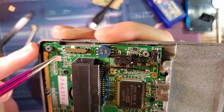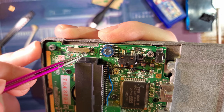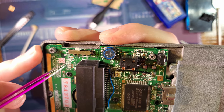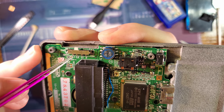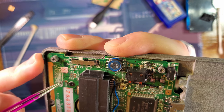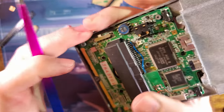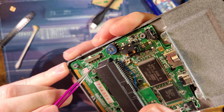Switch it off, and so on. So we can retain the ground input and then the battery input. We don't have to modify those whatsoever, but we will have to wire in parallel, as it were. But the common input, we need to be between the Game Boy and the switch. Now, unfortunately, on this specific console, I'm going to have to pull this motherboard out just to get to a good place to solder on here.